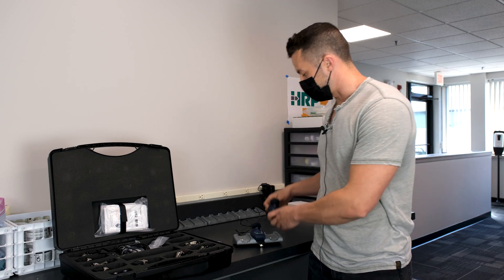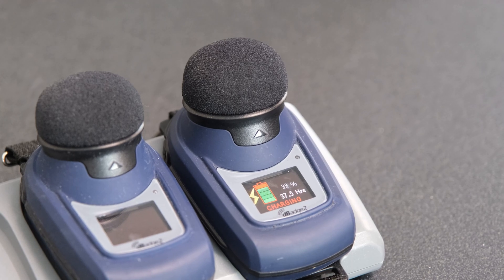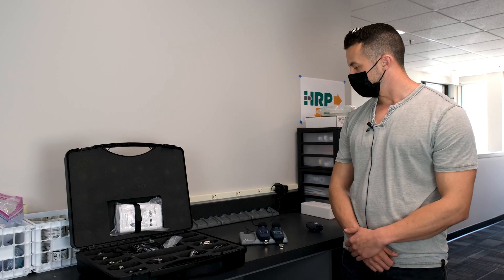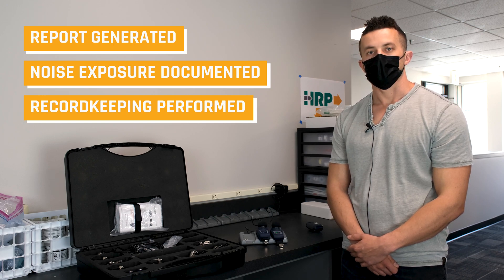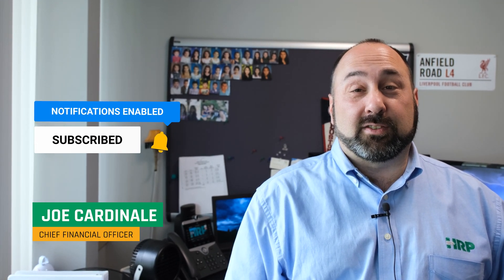Turn it off, place the windscreen back on, and be sure to download your data and delete the data for the next sampling event — make sure it's charged. Place the Casella D-Badge dosimeter back on the charging port; from there it can be linked via USB to your computer and the Casella program. Data can be downloaded, interpreted, deleted, and further managed to generate a report documenting the noise exposure and fulfilling record keeping requirements. This exposure can then be compared to our OSHA time-weighted average and noise levels. Thanks for watching — don't forget to like and subscribe and hit the bell for notifications.